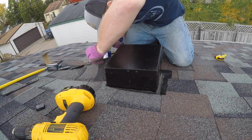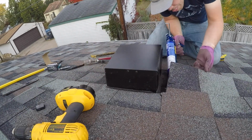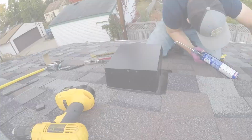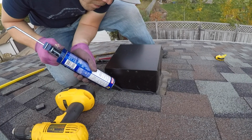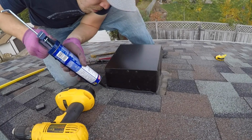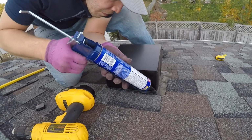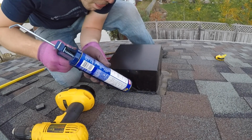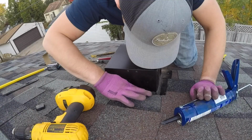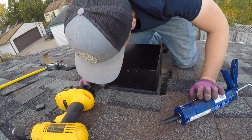After the vent was nailed in place, I applied a heavy bead of the same roofing caulk under the shingles that I had pried up for the installation to resecure them. I also applied a heavy bead of caulk behind the vent where it met the shingles, as I wasn't really able to lift them up in that area to do the same glue down treatment like I did with the sides. This way, water shouldn't be able to make its way up underneath those shingles, and instead should just go around the vent to either side. I smoothed the caulking out wearing an old gardening glove, as nitrile gloves were a tad hard to come by at the time.